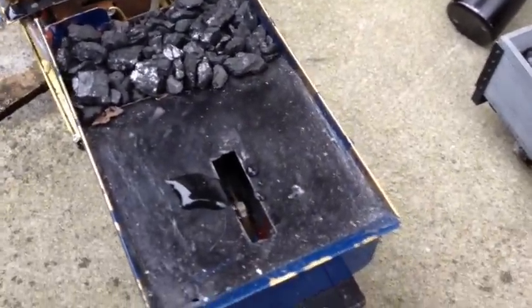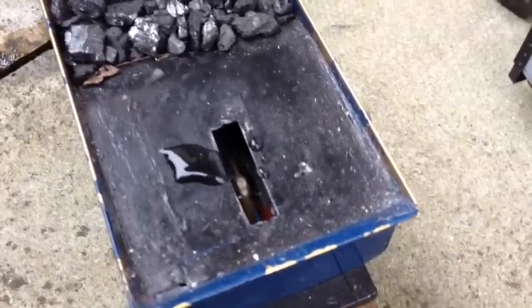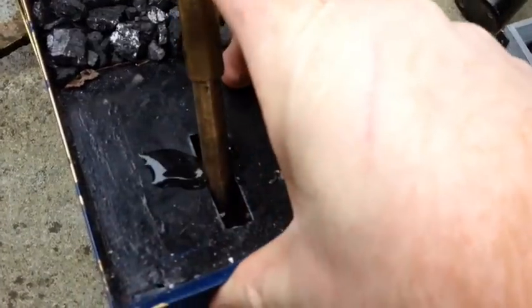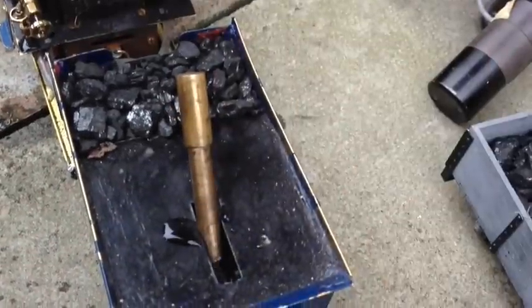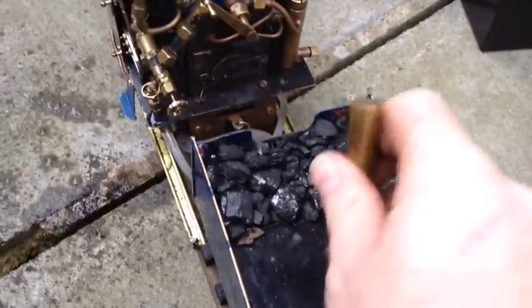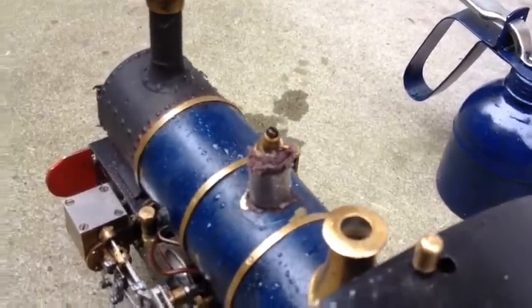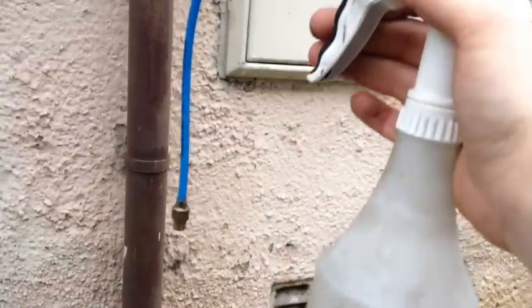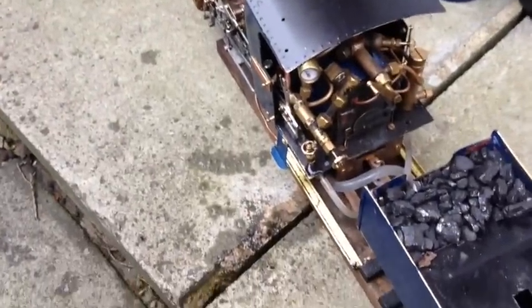For continuous running on a coal-fired engine, I have a tender on this engine with a hand pump inside. It's very difficult to do by hand, but basically there's a lever that you pump backwards and forwards to fill the boiler, and there's also a valve there for using the Jackson's miniature water pump. I would recommend this water pump — it pumps in a lot more water than a standard bottle and personally I think it's essential for coal firing.